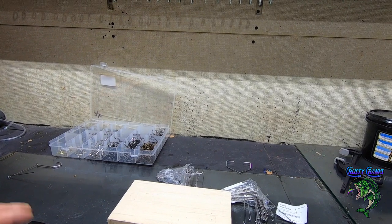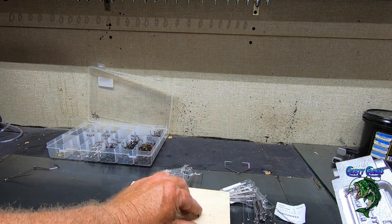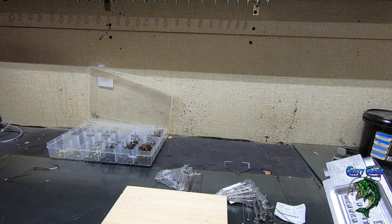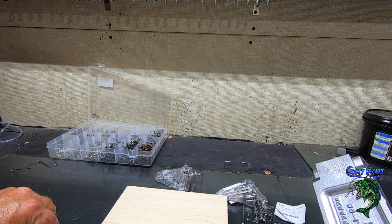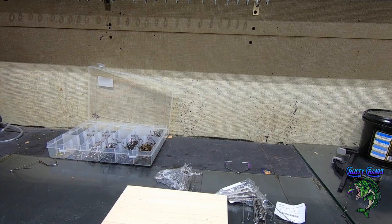All right. Okay, so that's the simple spinnerbait pour. Let's get them cleaned up and get some powder paint on them. I got a new way that I've been epoxying these. That'll show you that since this one has a raised eye, we're going to paint a little eye on there and we're going to need to put a little epoxy on it. Plus, it just helps protect the powder coat a little longer, I think. All right, so I'll bring you back when we're ready to powder coat.